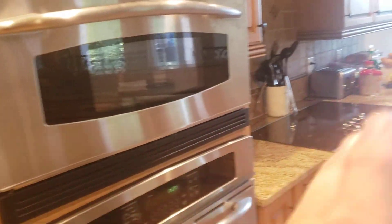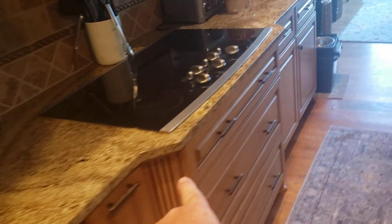The center line of the cooktop is going to be three plus 31 and a half plus 21 plus 18. That's where the center of this cooktop and the duct is going to be overhead.